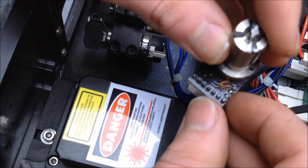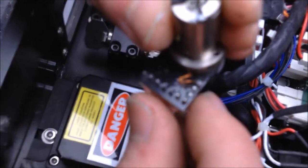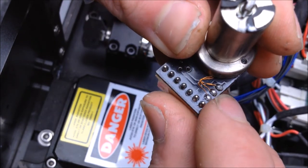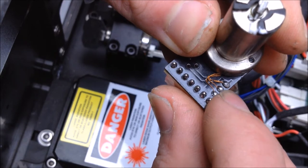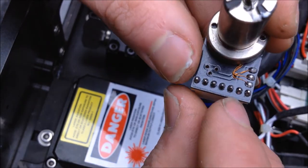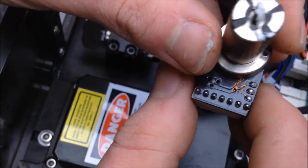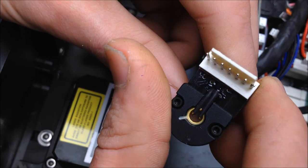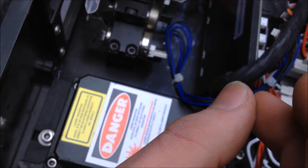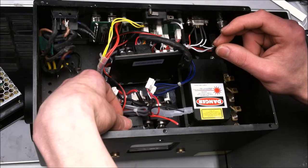Okay. Yeah, these are joined together. Get a better focus on that. Alright, perfect. So, yeah, these coils are joined together here, and then I've got the two inputs of the coils connected to these two pins. Common ground, photodiode 1 and photodiode 2. The series chain and the IR LED. Pretty straightforward on that. Gonna need another mirror as well.